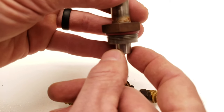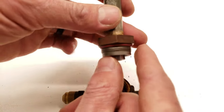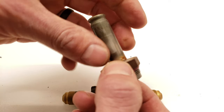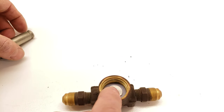The weight of the iron core is dropping it down when this is in the vertical position, as well as your spring pressure pushing it down. When you power the coil up here, it's going to suck this iron core upwards. And when you take the power away from the coil, it's going to allow it back down again. When it's down, it's going to be pressing down on the disc right here.